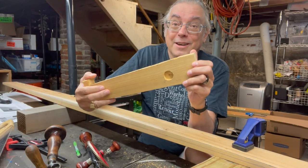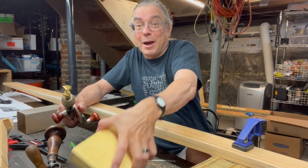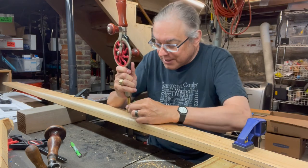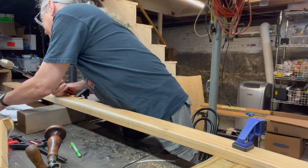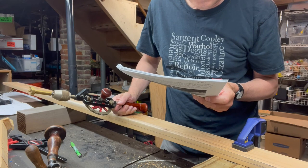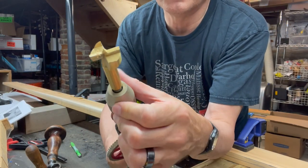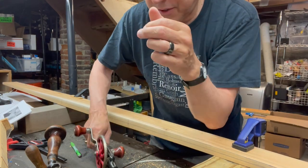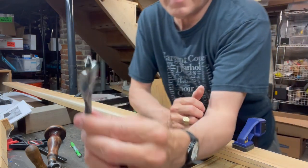I did make a test hole so I don't make a fool of myself too much. It makes you appreciate power drills, I can tell you that. This is what's called a Forstner bit. It has a sharp point in the center so you can center it, and nice cutting blades. If you're used to cheap drills, you'll have something that looks like this - I think this is called a spade bit. These leave really nasty holes. If you're trying to drill holes for a deck carriage bolt, this is fine, but if you're trying to do fine woodworking, you need one of these.